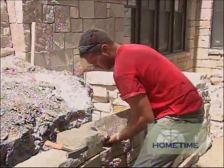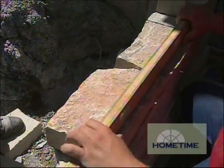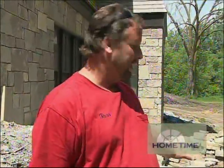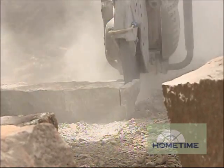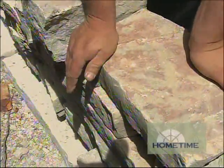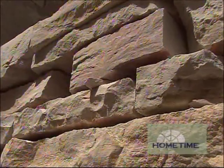To a certain extent, these must rock quite a bit — it's just difficult to get these things to set down like a manufactured product. Yeah, very difficult. It's a puzzle for us. We're taking the block, pretty much a pallet, taking it apart, setting it on the ground, and putting the puzzle together. And you can cheat a little bit by using that grinder from time to time. We have a grinder and a cutting wheel, so we can grind them to get them to fit a little bit. And then we're also using shims in there, and there's nothing wrong with that because those shims are going nowhere — when you backfill with all that rock, they're wedged right in and locked.